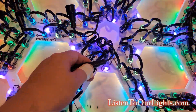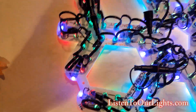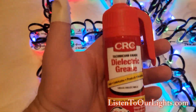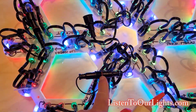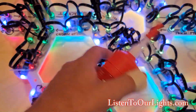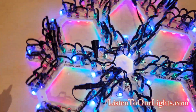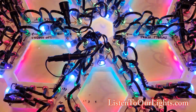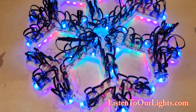The connectors I haven't finished off yet. What I do is, after I get the connectors on, I take dielectric grease — especially for the ones I'm always going to leave connected. Just a little dab will do. I put it pretty much over the rubber gasket and starting on the rings, and then when I tighten it down it kind of fills in the threads. That gives you a nice, nearly watertight connector. I'll do that for all of those to make it a little better.